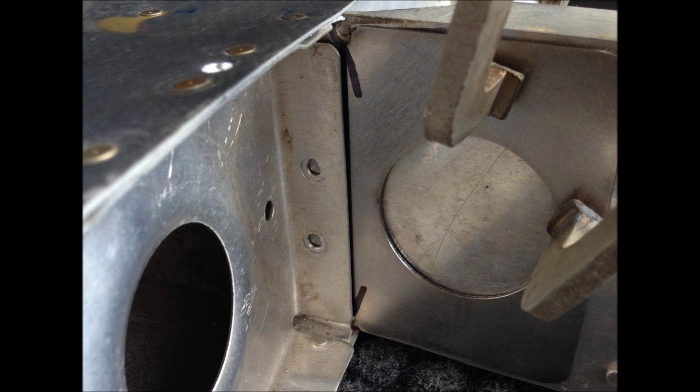At that point, put a couple of clamps on — some good vise-grip type welding clamps — to hold the stainless part in place. To locate the stainless part, once you've divided the line you've put on with the permanent marker, move the stainless part up and down to center it on the spar. There should be about an eighth of an inch of spar at the top beyond the stainless part, and an appropriate amount below.